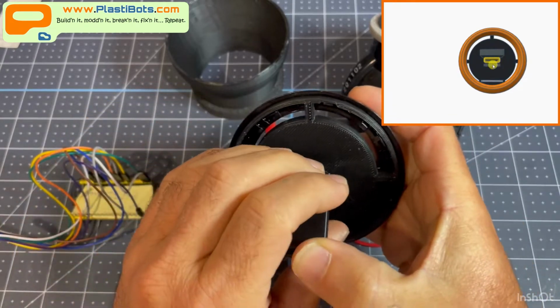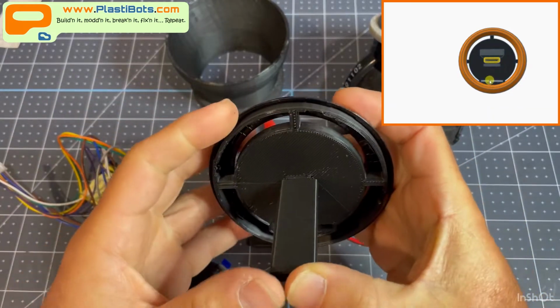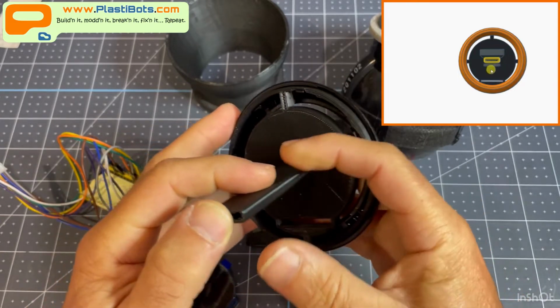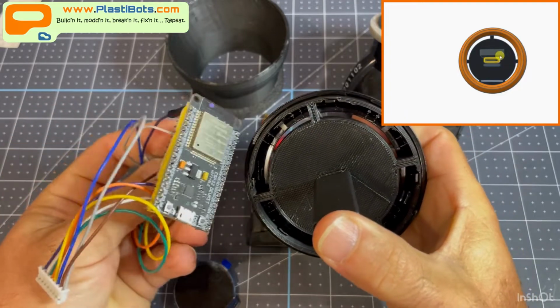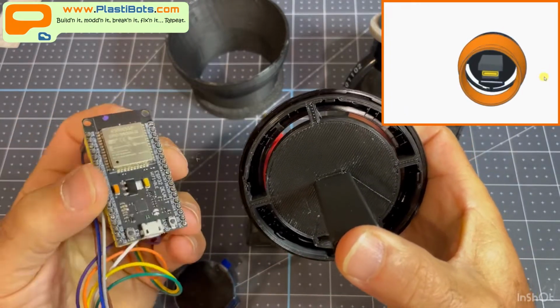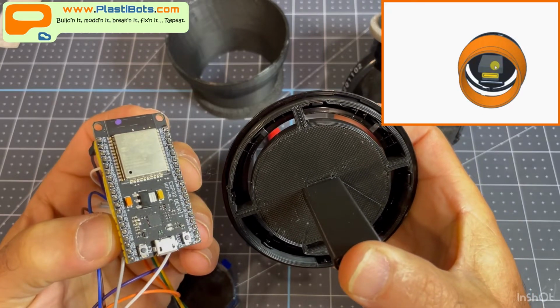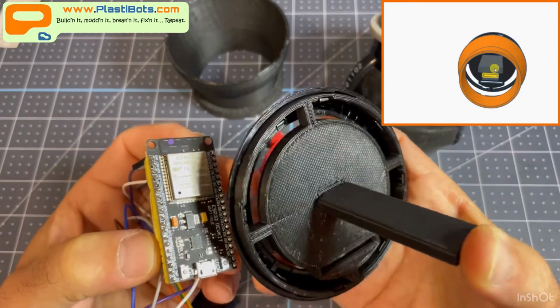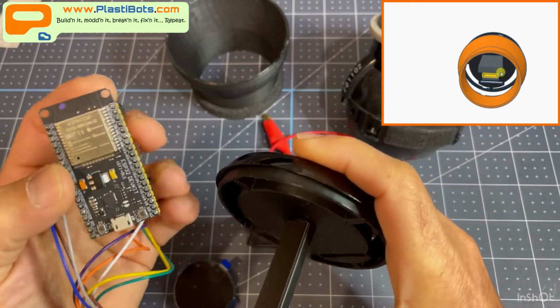And that'll basically be the controller and the actual screen, obviously. And then in terms of powering it, all I need to power the microcontroller is essentially a USB cable, or I'll probably pull a 12 volt to 5 volt with a switching regulator, or 3 volts, depending on which way I want to go with this.